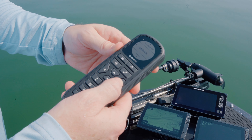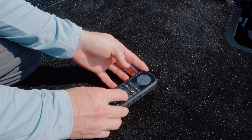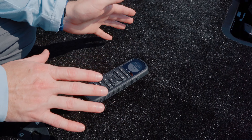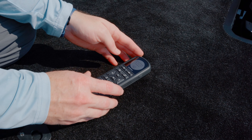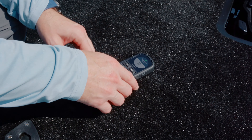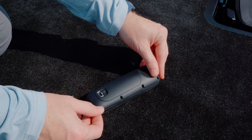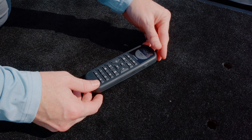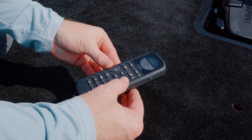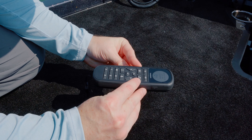You've got to calibrate the remote first before you can calibrate the trolling motor itself. Once you get your remote unpackaged and you put your two AA batteries in the back of it, you're going to get your remote turned on. This is the menu button right here — you're going to select the menu, scroll down to settings, go over to trolling motor and remote. We've got to get the remote calibrated first. So we're coming over to the remote control, going to hit over to the right, come down to calibrate, and we're going to calibrate the remote for the trolling motor. Garmin is going to walk you through the steps step by step on how to do this.